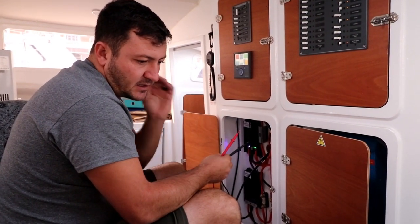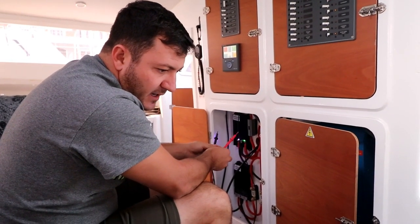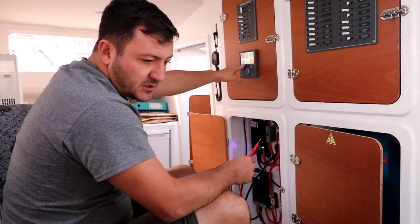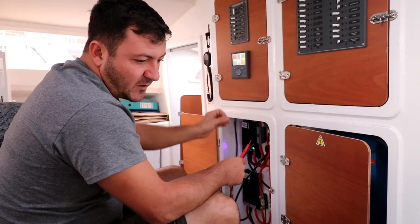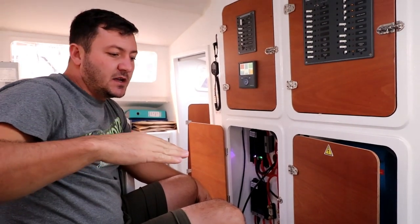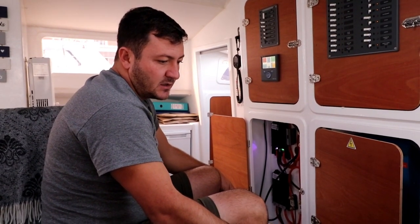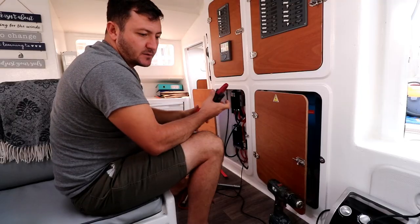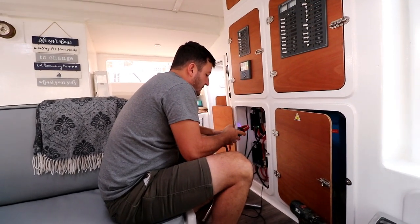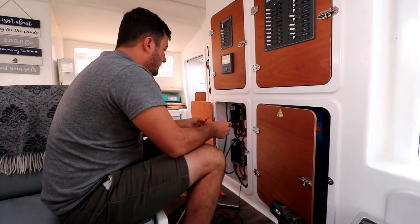So it's drawing down the alternator now, and it's giving us output current 40 amps and 40 amps over here. So we confirm we're charging at 40 amps. Output voltage 13.8, because we're only at 78%, so it will bring the voltage down, and as the battery starts filling up, we'll come to our 14.2 where we want to be at bulk. A lot of juice. So step one of checking this one is fine, but we still got to check what happens when they're both running.